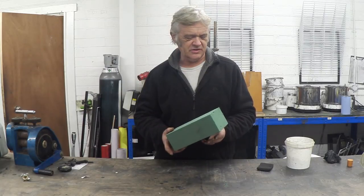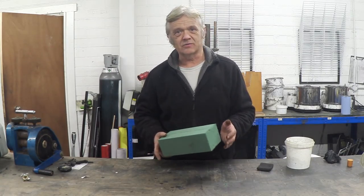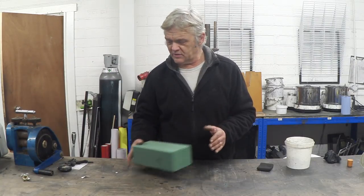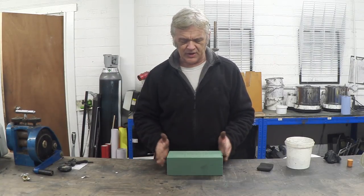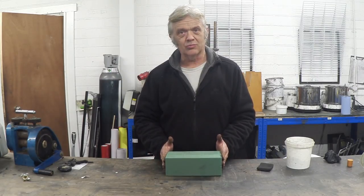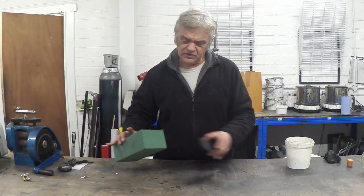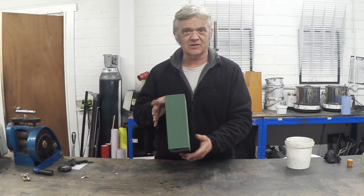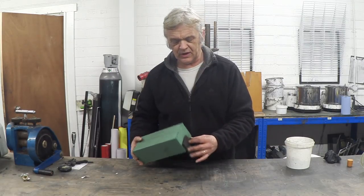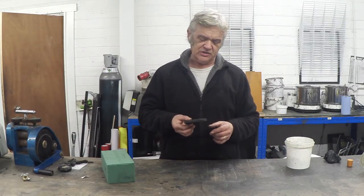Oasis is really, really cheap — I think I bought 20 of these for about five pounds. It cuts beautifully easily. Now, when you're carbonizing this it loses a huge amount of its volume, so if you try to carbonize the whole block it's not going to work. I cut off a centimeter, and this is one centimeter — that's how much you'll lose in the carbonization process through shrinkage. It began as a centimeter and it's now 0.8 centimeters, and I carbonized that to get a block of carbonized Oasis foam.